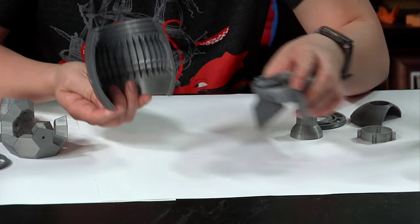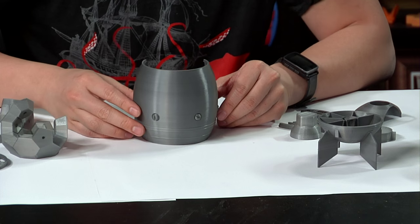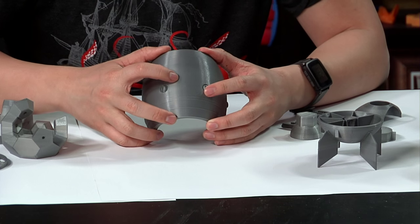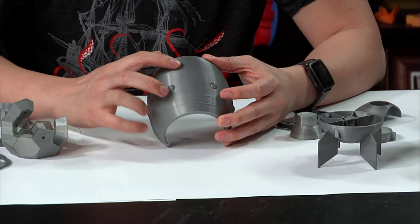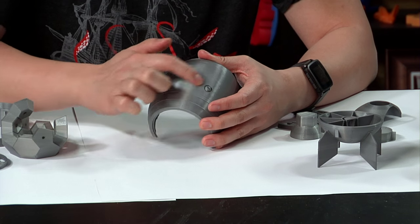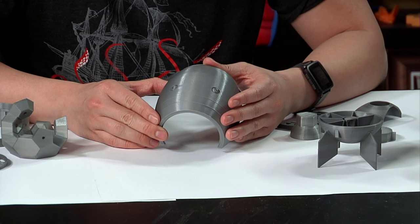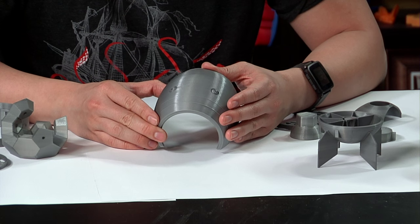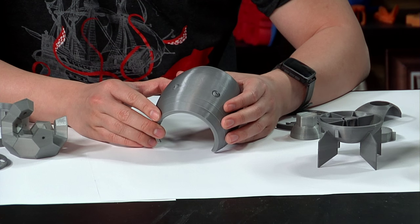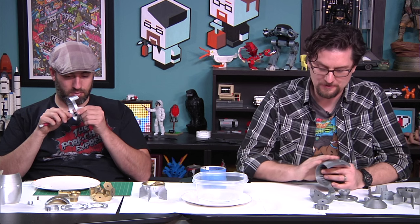What's also interesting is on this shape you can see it was printed with all the lines horizontal. Even so, you get a little ring effect — almost like a topographical map, where you get rings that go all the way around. That can be related to your layer resolution, or it could be an effect of the model itself — if the model was slightly blocky rather than perfectly smooth. But it's just a slight artifact, and you could sand it out pretty easily.